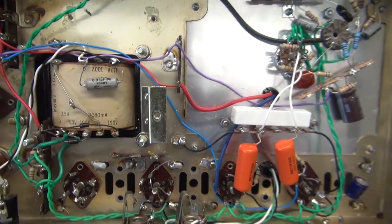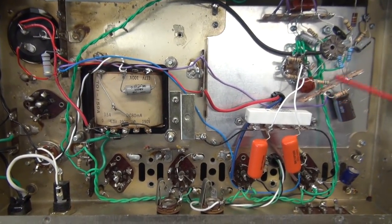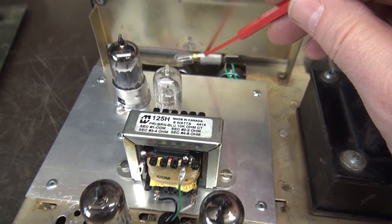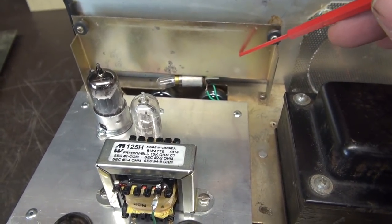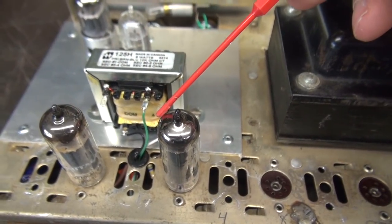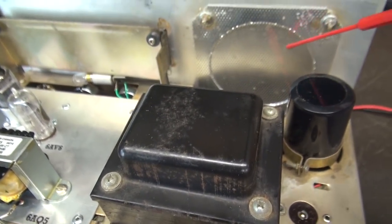The project is wrapped up - it all fits in here very well. Topside: the GE-47 dial bulb was reused so the front glass lights up just like it used to. Here's the 12AX7 preamp, the 6AV6 inverter, the output transformer, and the 6AQ5 output tubes. The power transformer was reused, and a new filter cap was added.